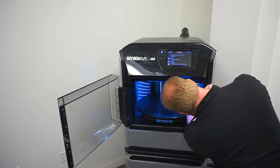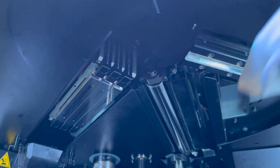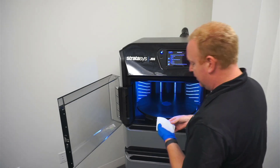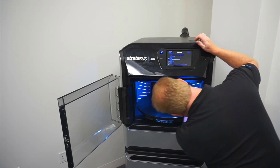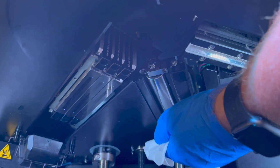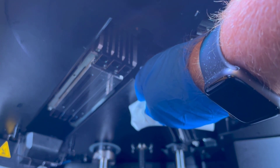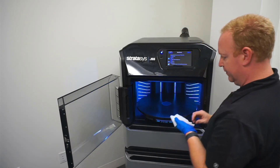I always like starting with the UV light — just give it a quick little rub. What we're trying to do is keep off any little droplets of material from caking on top of the light and preventing it from shining properly. Then I flip it to a new spot so I'm not putting any dried gunky material onto the next part. I just slowly drag my hand along the roller because it's spinning for us, going from back to front to get it all the way clean.